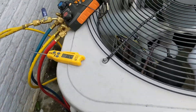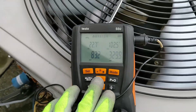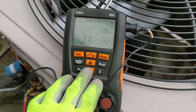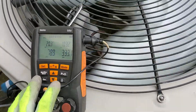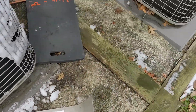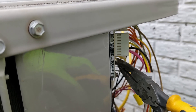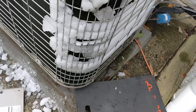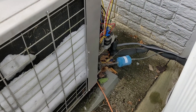Let's go back to the pressures. Temperatures come up just slightly, come up a few more times. Let's see if this thing will go, and then I'm going to double-check that we're getting a signal back on W.